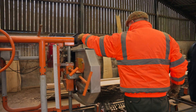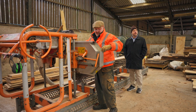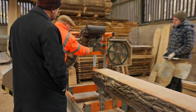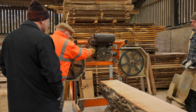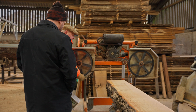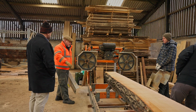What you've got is a V-twin Honda engine that drives that pulley over there. I'll just take this guard off so you can see what we're looking at. Come around and take a look on the inside here. The Honda V-twin engine drives this pulley that drives that wheel over there. As that wheel turns, this saw blade rotates — you've got a band of steel with teeth on it, constantly cutting in one direction. This machine travels up and down this track.